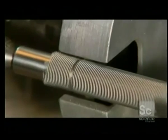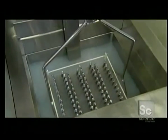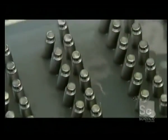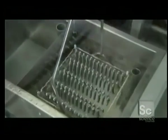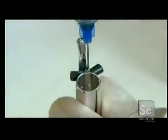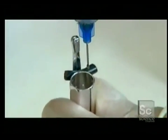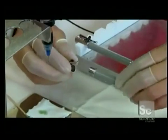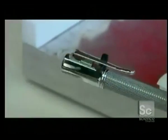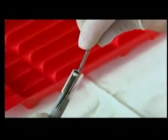Now on to another model, this one decorated in chain mail. Workers cut the material to pen length, then fasten it around the brass pen casing. After several washes in water and solvent-free detergent, followed by several rinses, they precision glue the tip and cap to the casing. Then they insert the cartridge, along with the spring, to provide resistance when the ballpoint presses against the paper.